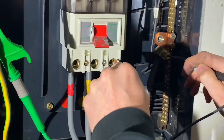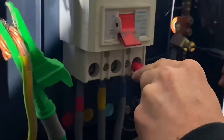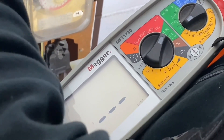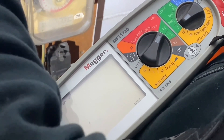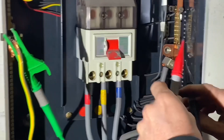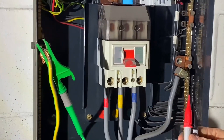If you notice, every time I physically take the probes back off in the right order — exactly the same as we do for supply polarity and safe isolation. So 0.08 on the third phase. Okay, so we've carried out the external earth fault loop impedance test, we've got three readings, and we're going to record the highest one in the test paperwork.